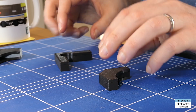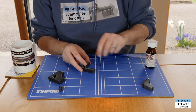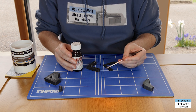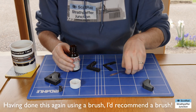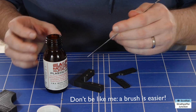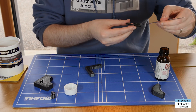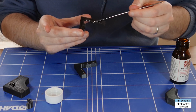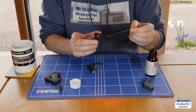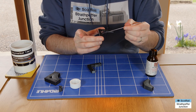So what I'm going to do now is to weld the plastic together. I have learned from mistakes by having these two too close to each other with the lids off, and then the magnets fly out. So we'll pop one to one side, take the lid off this one, and all I'm going to do is use the plastic weld with a metal spatula - this is a Tamiya paint stirrer - to hook out the plastic weld and lay it on and spread it out. One thing to mention: if you're using a metal spatula it is going to stick to the magnet, so do be careful. I should also mention that normally I wear gloves for this, but I started filming and forgot I hadn't got my gloves on - point off for me there. It's pretty nasty stuff, so I do suggest you don't get it on your skin too much. That's probably enough here.